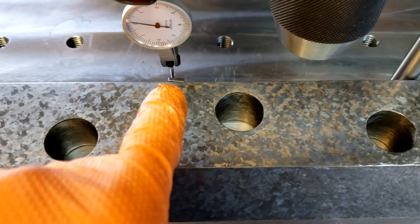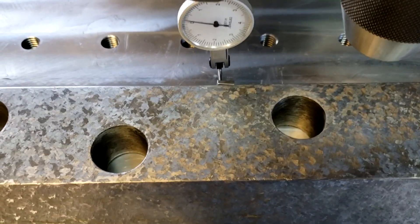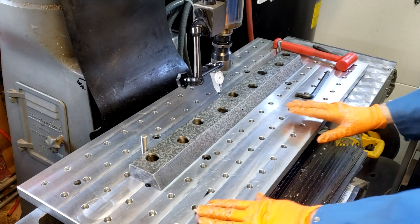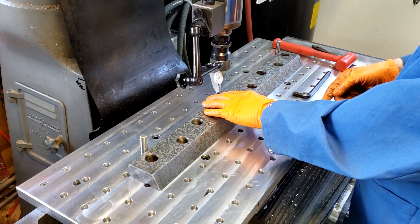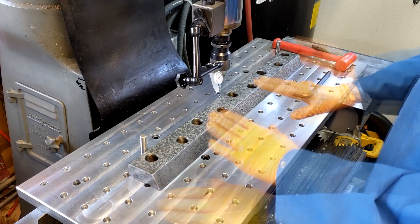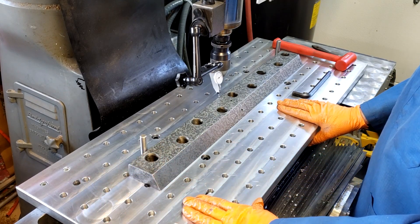You can see here I put a gauge block between the indicator and the straight edge because the scraping has dips and doodles in it. I went ahead and ran it all the way across and I am getting within one tenth of being square, so I'm good with that. I finished with the plate alignment. I'm within one tenth and I have more Gibb travel than that. If I really honk on the table I can get a couple tenths. That's as close as I'm going to get to this fixture plate parallel to the axis of travel. I'm real happy with it.